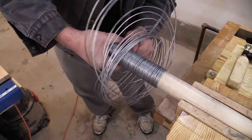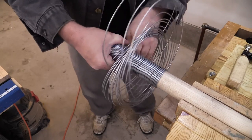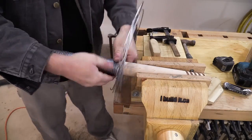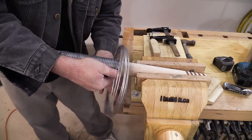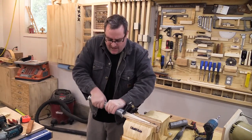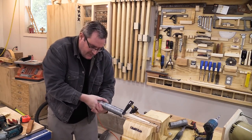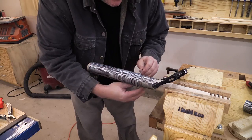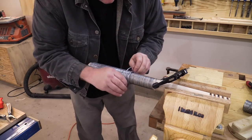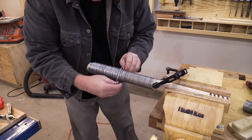It'll take about the same amount of time as it took to do this, but when you put things in perspective, it's not really that long. Once you know what you're doing — which I really don't know yet — it would take very little time, a couple hours, to get something like this done. Then you could let the epoxy that's going to hold it in place set overnight. Next day you've got a big lead screw for a vise. The one I just wrapped on is nice and tight. I just need to tighten up the other one, starting at the end and twisting it while pulling back to compact them together. I'm uncoiling the original one now. The second one I wound in is not as tight as I could hope, but the spacing is not that bad — it could use a little adjustment, but I think it's workable.